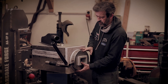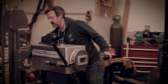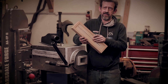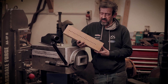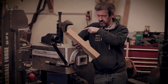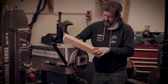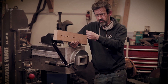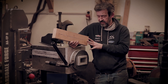I've also drilled the ribbon burner block now. What I did was make a jig on the CNC — though I was trying not to use the CNC so you guys could follow along; you could make the jig on a pillar drill just as easily. The idea is it keeps the drill going straight into the block so all the holes line up inside. I did get a little bit of chip-out, so I marked the drill about a quarter of an inch from the end, switched off the hammer action and used just rotary, and that sorted it.